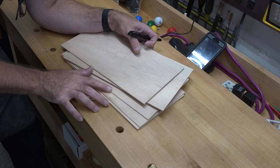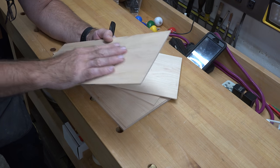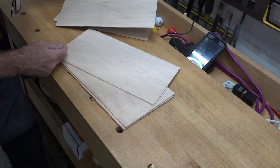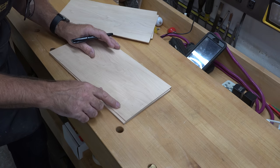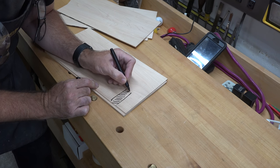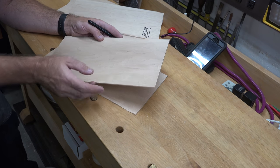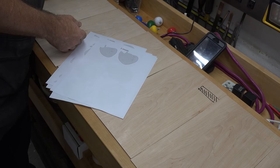We have all our stock milled now. You want to go through and look for imperfections, because we're going to be laying patterns down on this and you don't want bad obvious imperfections in your pieces. You want a nice flat surface so everything mates together. When you find a flaw — like there's one right here — don't be pretty about it, put some lines through it. Mark it boldly so you don't get those bad sections into your project pieces.